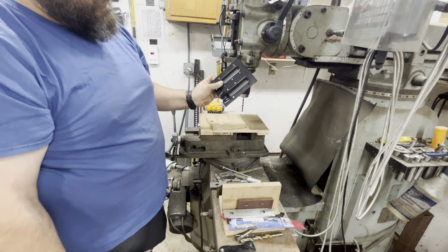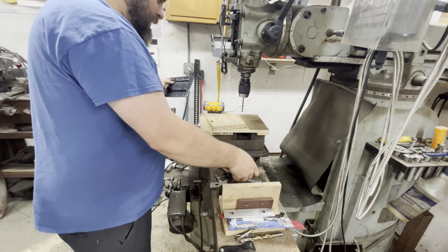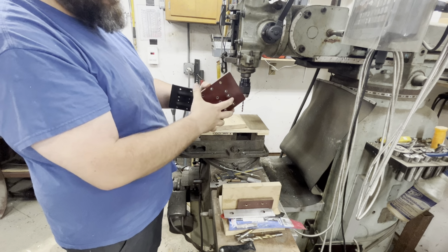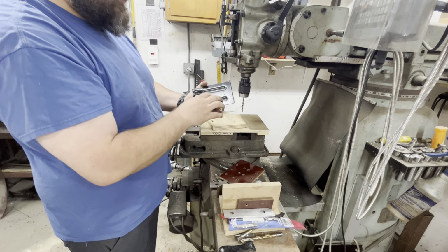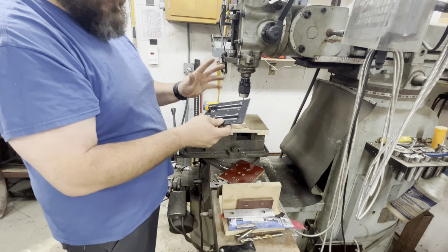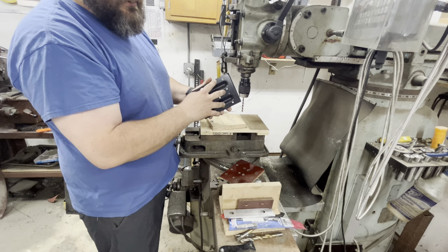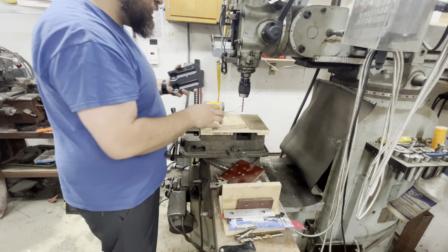So now we've got 12 very precisely located holes. Now there is one little caveat to this: I think when I made these, I didn't exactly center them up. So when I cut this apart and trim my dies flush to this and try to mate them back together, these holes are off in a couple spots by maybe a few thousandths. And that could kind of mess up my sheath when I press it together to bind things up. It won't lay as flat, and it won't go together as smoothly as it needs to.